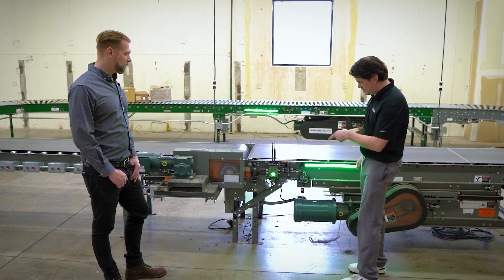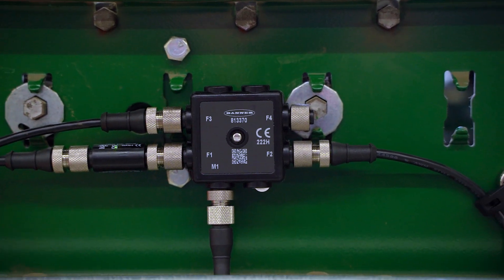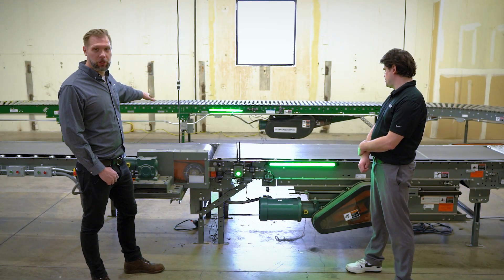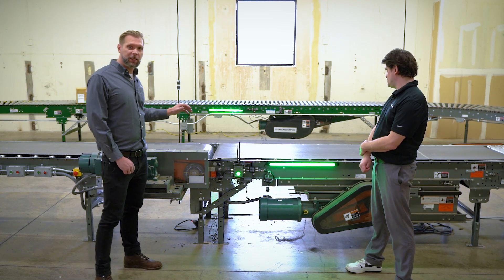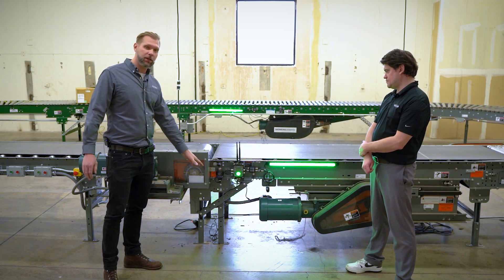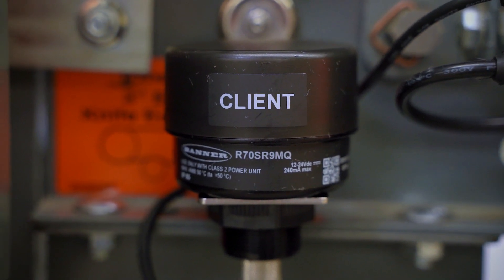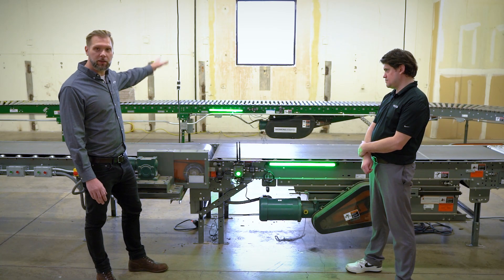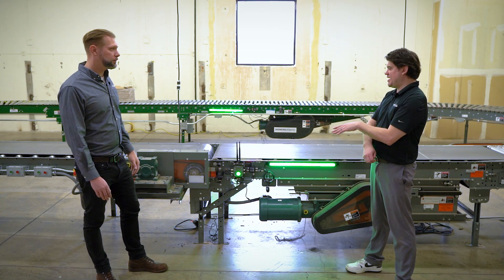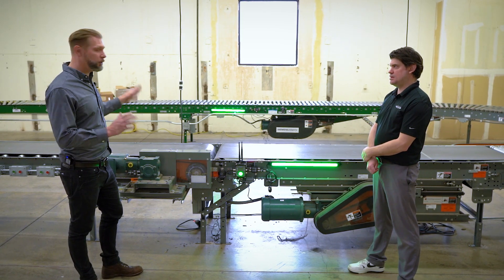Now what I don't understand is why do we have a little serial radio on the other side of it? On the other side of this conveyor, we actually have the same thing going on — monitoring vibration and current over there, as well as indication of any alarm states. But in this particular case, we're not going to wire a serial Modbus line all the way to the other side of the conveyor. We're going to cut that cable and make it wireless using these R70 nodes. So we're monitoring directly at the controller with the serial Modbus line, and also across the conveyor — a copy-paste of the same network. That is more of a simple wire replacement, and that's what Banner is really great at.